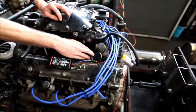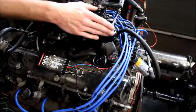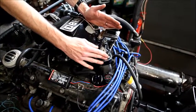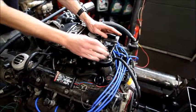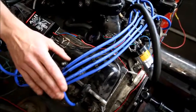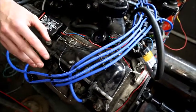We've got a cheap rev counter from eBay just so we can set that manually for now. We will however be controlling it electronically via this heavy-duty servo - I've got a small computer that we've been programming for that, and that's pretty much working spot on. We'll do another feature on that later. Ignition-wise, of course MagnaCore ignition leads - absolutely essential to any engine upgrade, getting the best spark possible down through to your spark plugs.